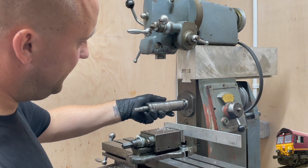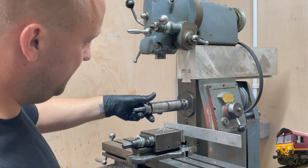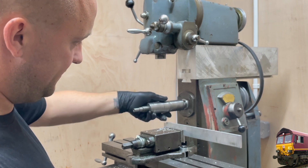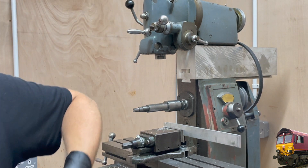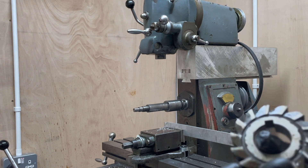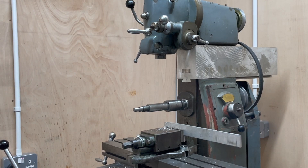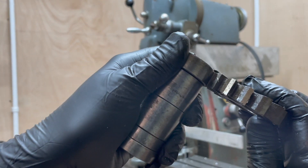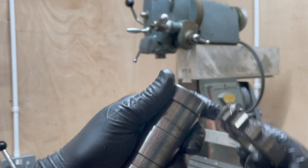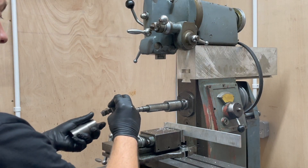These are all the spacer rings. I'm going to leave the larger one on there, which would only be removed if we're going to use a big slab cutter, which we're not. I'm going to find a cutter — let's say, for the sake of argument, this one — and see how thick it is. It's as thick as that spacer ring, so we'll leave this spacer ring off.